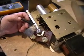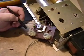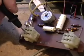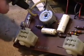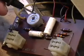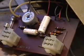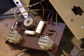Alright, this came in as a Rhodes power supply, and what we did is we went to the chassis, and then you're supposed to measure 24 volts here, plus 36 and minus 36. Well, the 24 volts was absent. We went to the board with the regulator on it. The power transistor is back here on the heatsink, and the Zener diode is shorted.